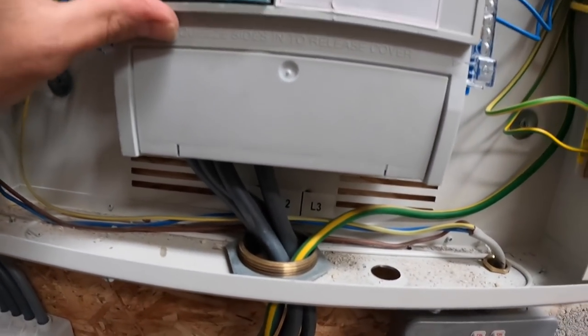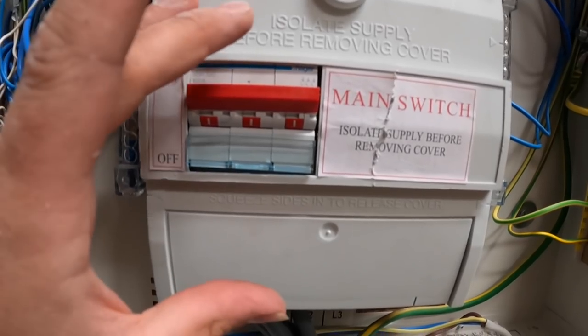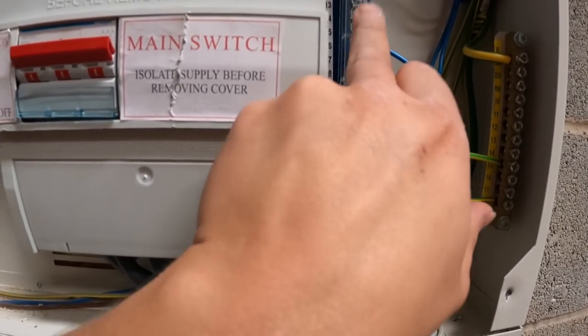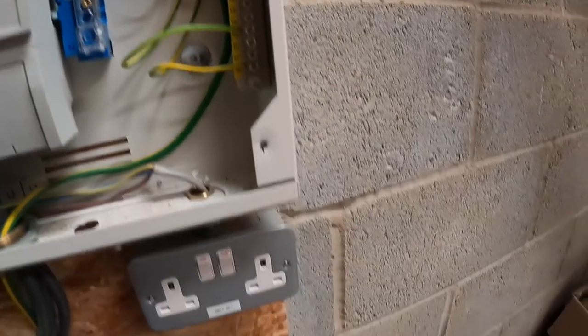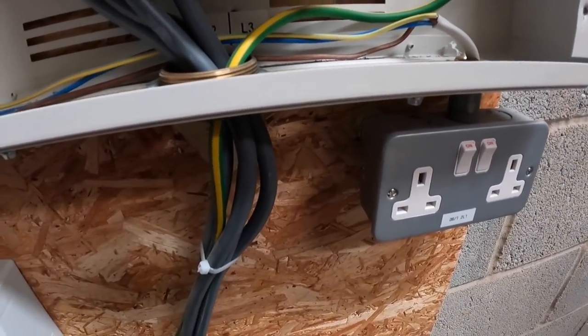This is a very safe board. It's on because the client's still working here, but you can't get a shock off this board. I mean, even the neutral bars are shielded. Look, really nice board, actually. So we're going to be going up here, L1, L2 and L3 with our three-phase breaker. We'll gland them in here, we'll set you up and we'll get it done.